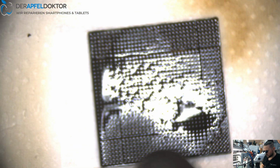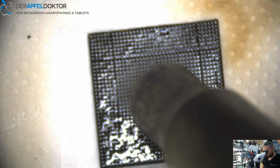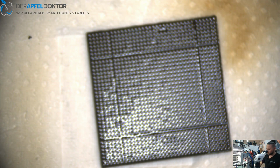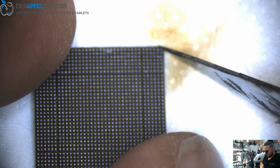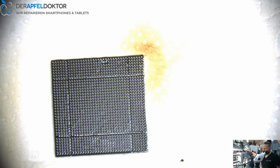And you see it's down. Just wait for the flux coming to all the areas of the CPU. Really nice, every ball the same size except one, which I set down at last, this one here, but I saw it before. And just do this tiny trick here. Bam! Same size. Okay? We are done.